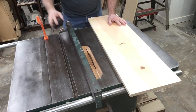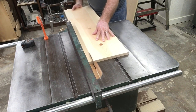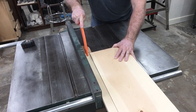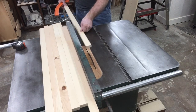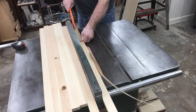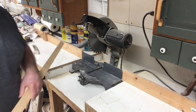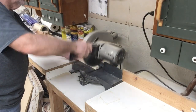For the flag I'm making today, instead of using 2x4s and ripping them down, I'm using a 1x12 that was 10 feet long. This is going to give me the necessary material to put this flag together. I'm starting out by roughly cutting this 37 inches long and then ripping my stripes down to 1.5 inches wide. This last stripe worked out perfect — all I had to do was cut a very thin strip off and I had virtually no waste. After this, I took all of the stripes over to the miter saw with the stop set at 37 inches to cut the final length.